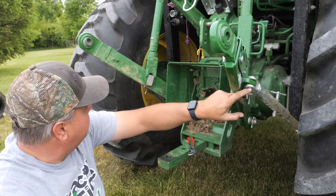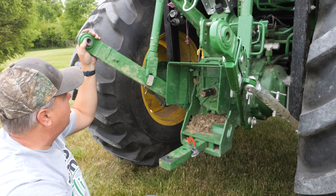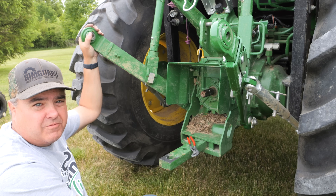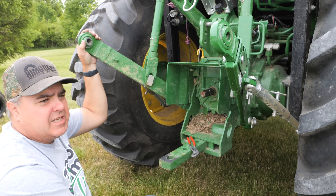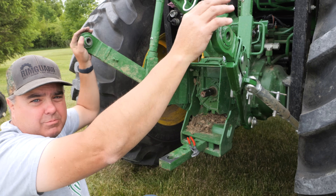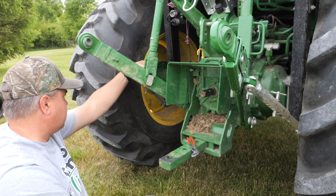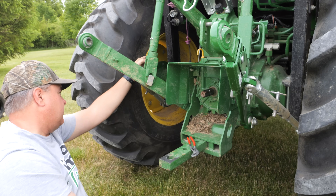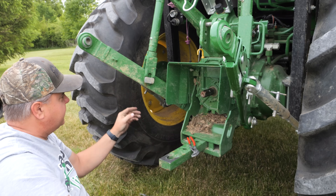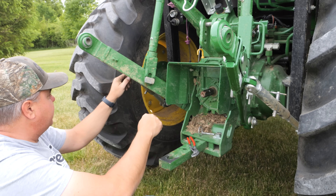I butchered that cotter pin so I need to get a new one. This is a good time to show a feature available on the 3 and 4 Series — not available on the 2R but available on older tractors. You can switch how this pin sits. Set it one way and you get vertical play in the attachment, so if it hits a bump while mowing, it can raise up without affecting the three-point hitch. It also gives side-to-side movement, helpful for a rear finish mower. You can also put the pin sideways for a fixed three-point. These are choices you don't have on the smaller tractor.